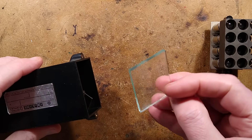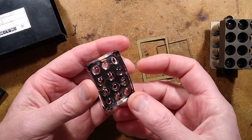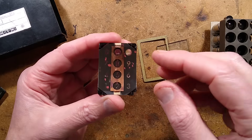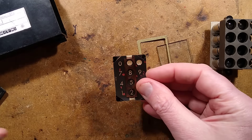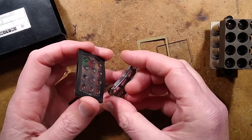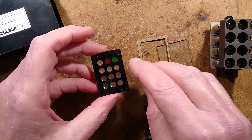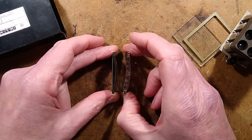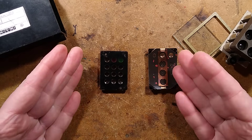After that we have a piece of glass, possibly a heat shield. Then a spacer. Then the number plate — light shines in from this side through a collimating lens, and then it has the numbers on a piece of plastic film held in place by a little copper strip clicked through. Then there's a space, and a matching set of lenses focus that image — this lens set is curved — through the mask, which has the colours over the red and green plus open points for the digits. So it's basically one lamp, a lens, the slide, a focusing lens, and a shield — that is how it projects each number.